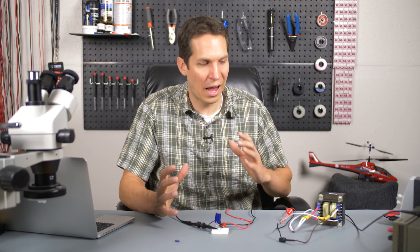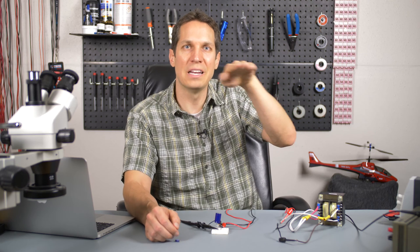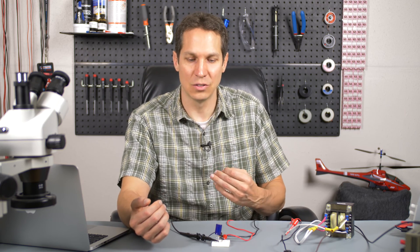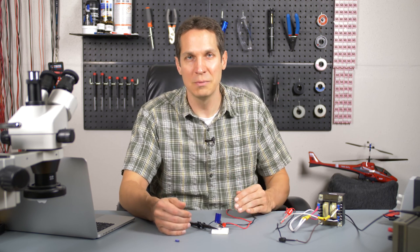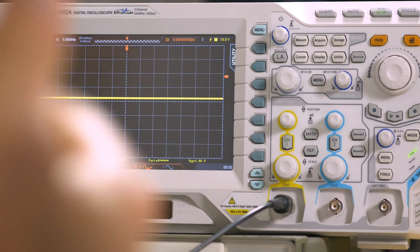So this is how a half wave rectifier works. It's super inefficient — originally we had just one waveform and then nothing, one waveform and then nothing, so you're losing half your power right there. We can do a full wave rectifier, which is a lot more effective, a lot more efficient, and a whole lot more complicated, and that will give you much better results. But we just wanted to go over the half wave rectifier to show you how you can use one diode to get a DC signal. So: transform it, rectify it, filter it — and later we'll talk about regulating it so you get exactly the voltage you want all the time. Hope you enjoyed this practical demonstration. If you like this video, give it a like, subscribe to our channel, and we'll see you later.